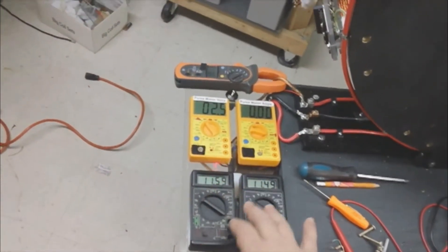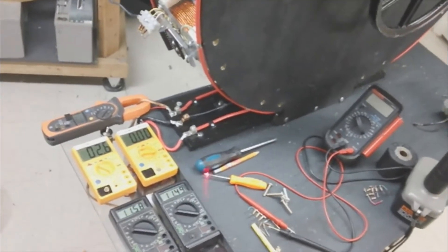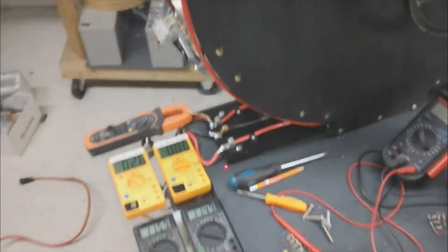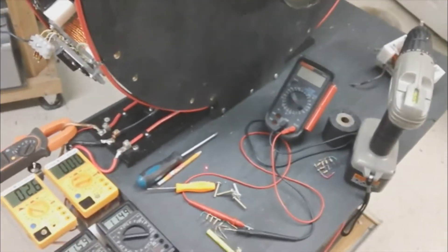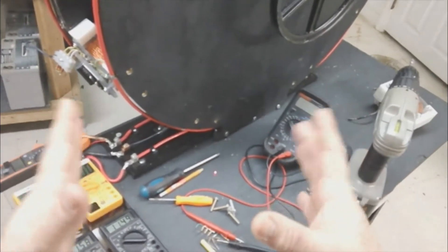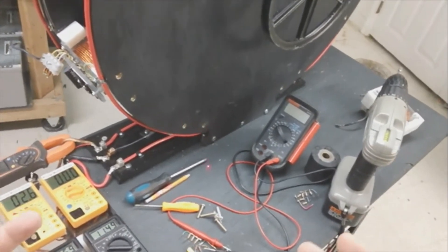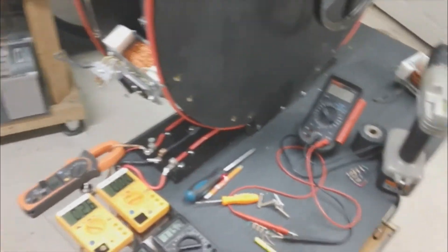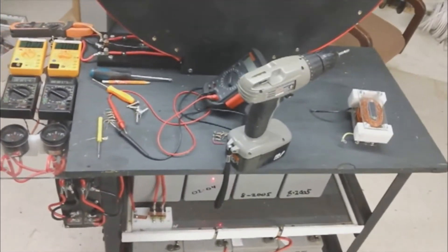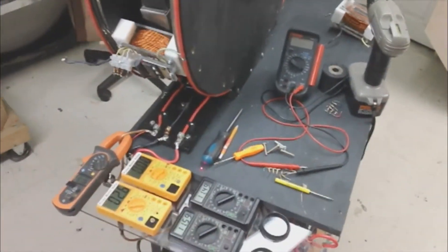Currently that's what the voltage is at. I figured out some of my batteries were actually cold boiled — where I wasn't discharging the cart motor completely, it actually boiled the acid out of the battery. And instead of swelling like you'd normally see, they were actually sucked in because they're sealed batteries. They created a vacuum inside. I'm going to have to get some acid and add it to the batteries. These batteries are from 2004–2005, pretty old, but they're all still working — just a little low on acid right now.